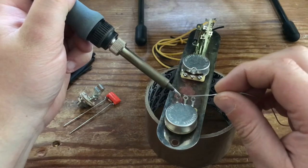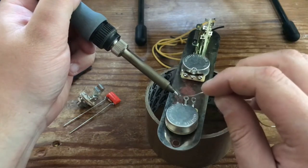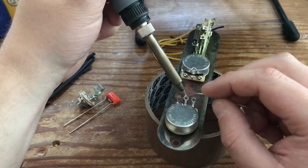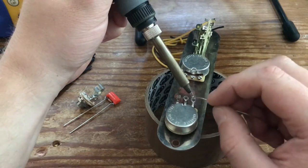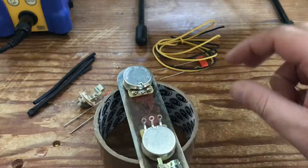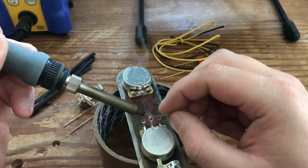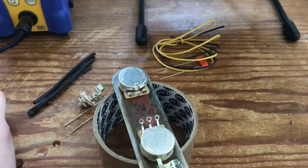So the middle one is the output and the third one on your volume control we're going to make redundant. I like to spend a couple of minutes following your wiring diagram and tinning everywhere that's going to need a connection later on. When you're doing these little eyelets, hold your soldering iron behind it and just float solder on from the other side. Because we're going to be grounding this one we can completely fill it. On your tone control, tinning this one and the middle, which is where the capacitor is going to go. The right one will be redundant — you can either snip it off or just leave it.